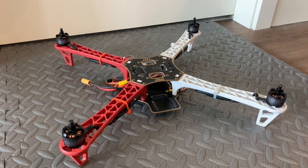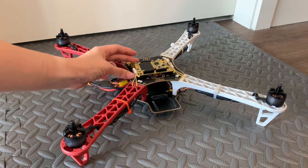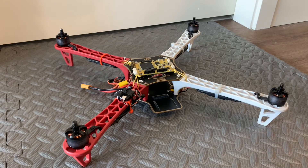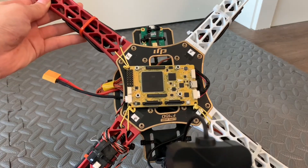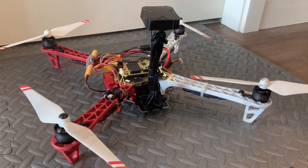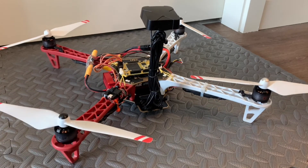Now we are going to mount all these electronics to the frame. The main circuit board should be secured to the main body of the quadcopter, and small rubber grommets were used as vibration absorbers. The RC receiver and GPS PCB with the antenna have been attached using cable ties. The GPS antenna should face up and high for better signals. Connect the motors to the PWM headers on the board, and install the propellers. Please make sure that you are using the correct propeller direction depending on the frame type you use.